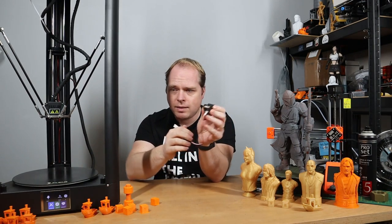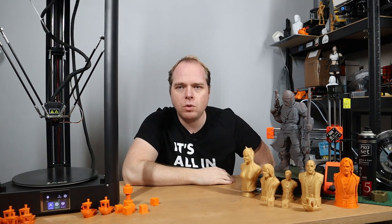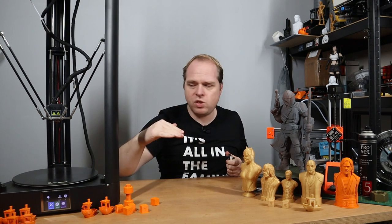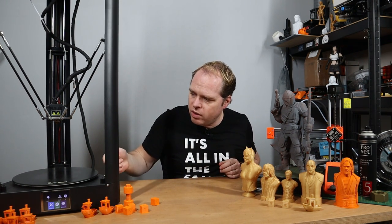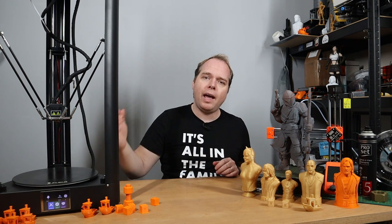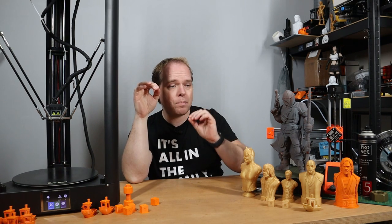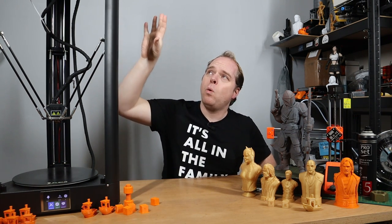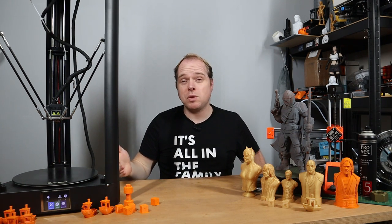How does it work? It's pretty easy. There's a magnet and you put it on there, then connect the cable with the connector and you can do auto bed leveling. After that, you run the Z alignment or Z position — basically the same thing you do on a normal Cartesian style 3D printer. You take a piece of paper, put it underneath the hot end, heat up the nozzle first, then use the up and down buttons to get the right grip on the paper. After tightening the belt knobs on top, make sure you run the auto bed leveling sequence one more time.